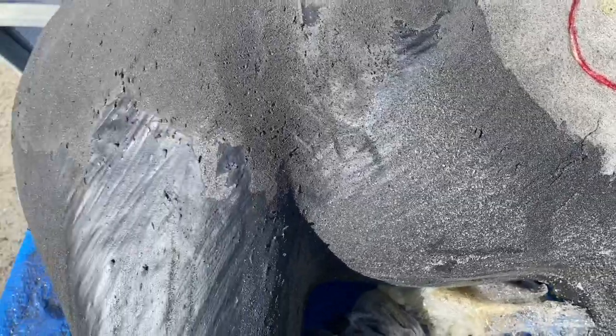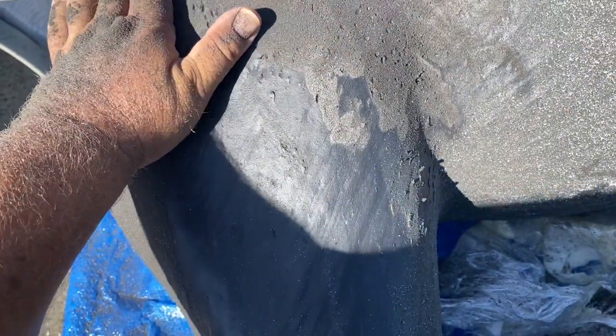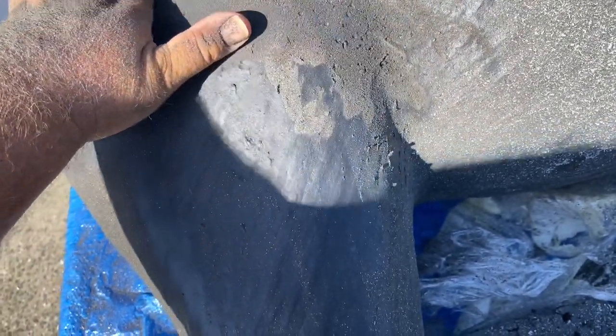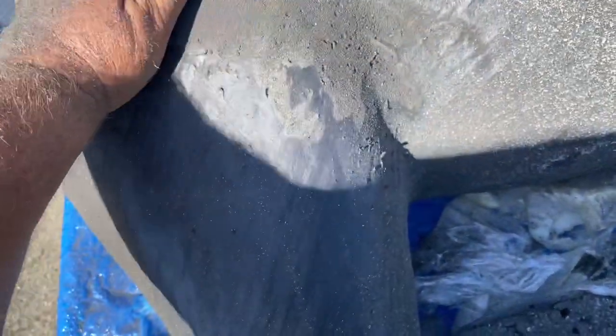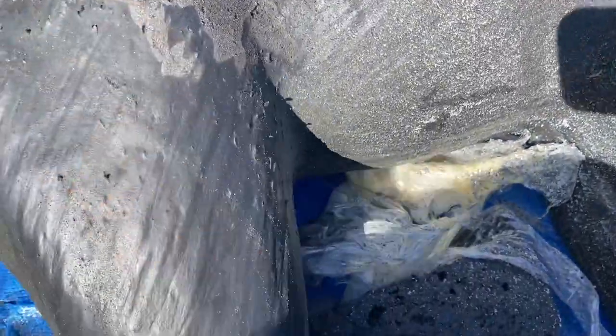Okay, just so you know, if you use a disc grinder, I used to be a disc grinder when I was younger at a metal job shop. You go very lightly and use the edge of the sander. Just let it lay on it at the edge and let it float over it. Let the sander do the work. Never put a lot of pressure. Just let it gently float over the edge. Okay, I'm going to hit up here real quick, and then we're going to go inside, get paint, and we're going to paint it.